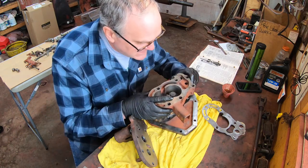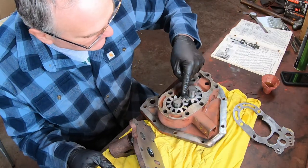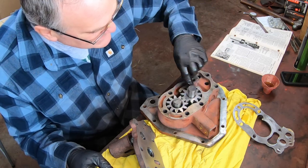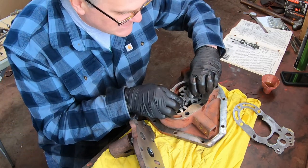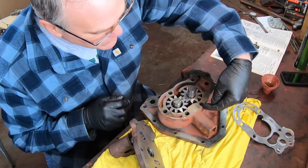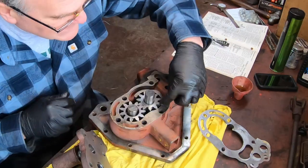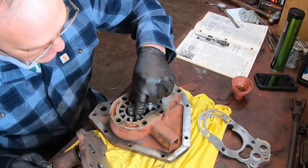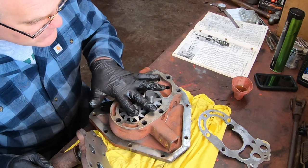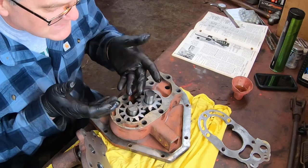The way this pump builds pressure is that when I put the housing around the gears, the oil comes in through the inlet and is spun around the outside face of these gears and compressed. That compressed oil is then brought into this passage. It's not the motion through the middle of the gears — it packs it around the outside. So the clearances that are really important are the clearance of the end of the gear teeth to the case, and the clearance on the top and bottom of the case — just like an oil pump, to keep oil from escaping past the end of the gears.